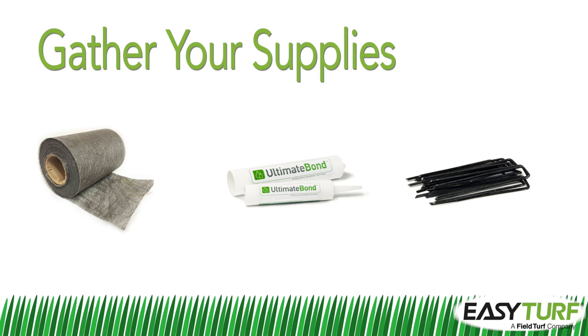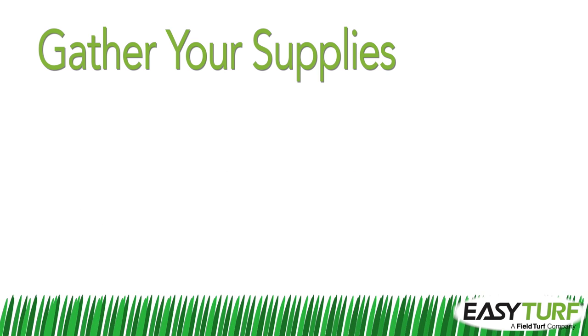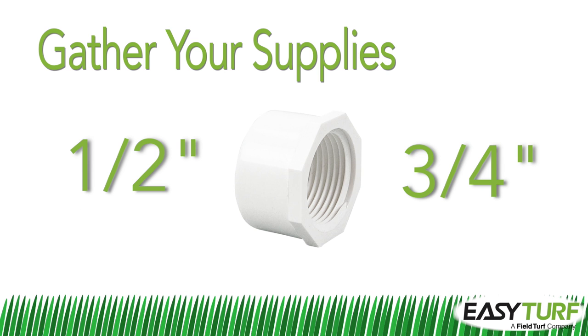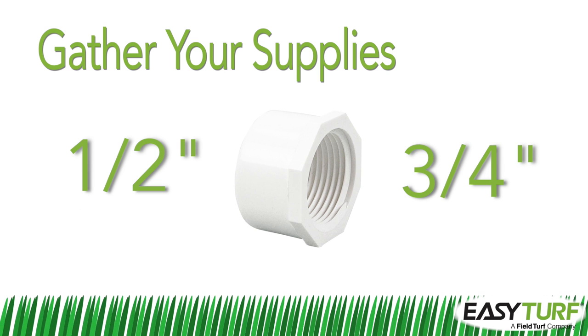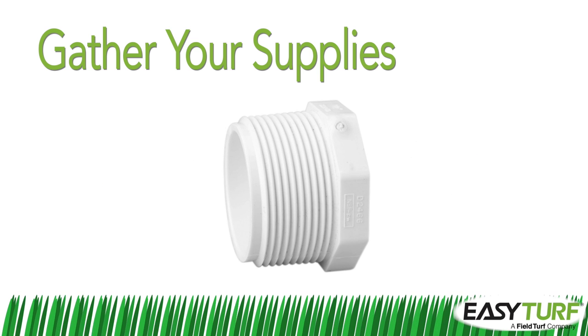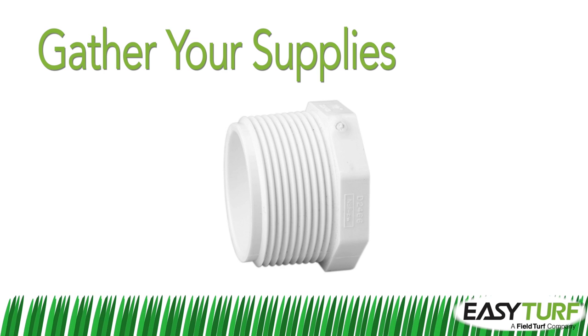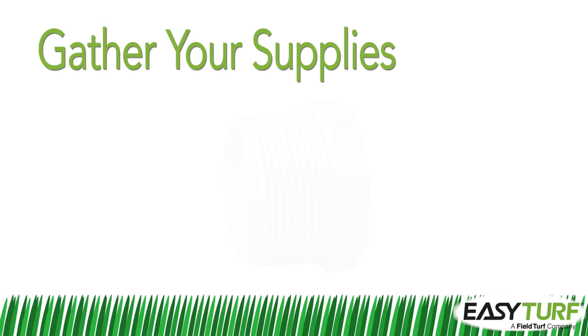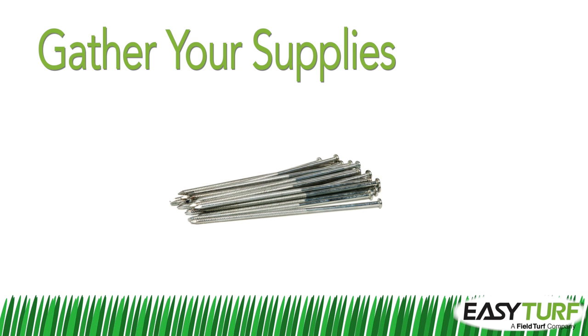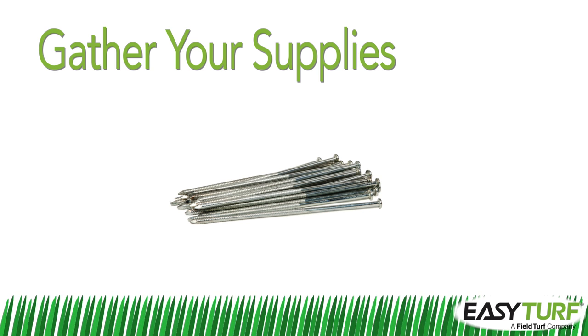Make sure to check your plan so that you have enough of these to cover the needs of your project. A handful of ½ inch and ¾ inch PVC threaded caps and plugs will be handy to cap off any sprinkler heads, and 1 inch PVC or poly caps/plugs will allow you to cap off an irrigation zone right at the valve. You will also need perimeter turf spikes — plan on spiking the perimeter every 4 to 6 inches, and every 2 to 3 inches for very tight curves.